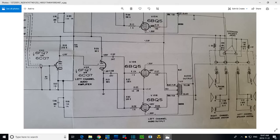Oh, here we are, cathode resistor. So you have a cathode resistor generating bias, if you like, over here. This is an ordinary voltage amplifier, I would imagine you could say that. Why they chose this arrangement? I guess maybe it has to do with achieving the seesawing of the voltage of this tube up and down between controlled, how can I put it? So the swing at the top is the same as the swing at the bottom. That's how I should put it. So the swing on these two lines is the same. Like if you had a 48 down here, then they wouldn't be the same anymore and this wouldn't work.